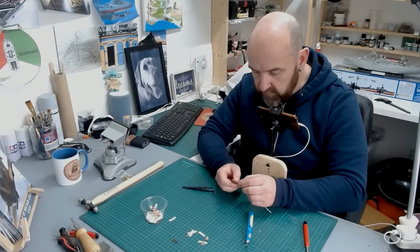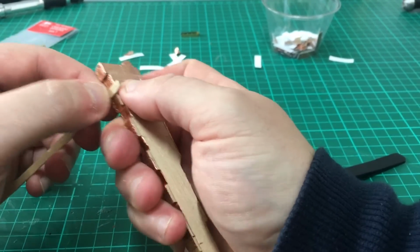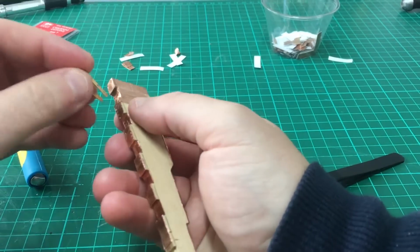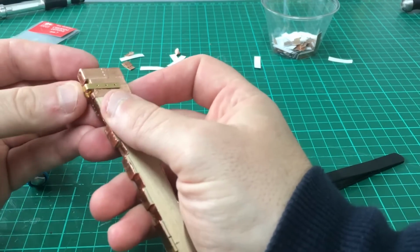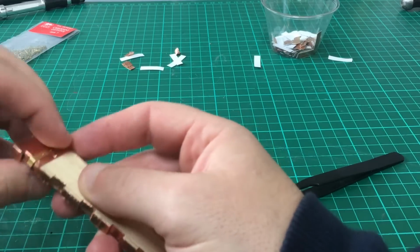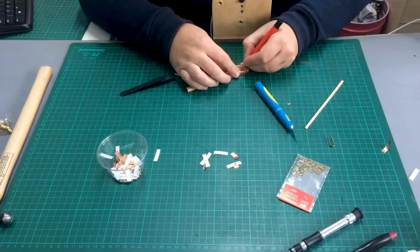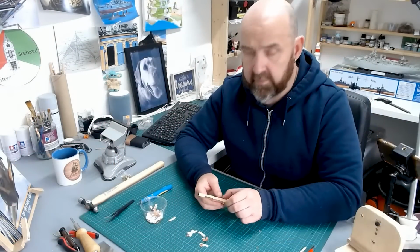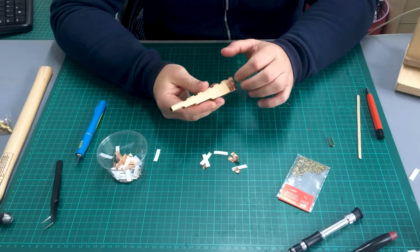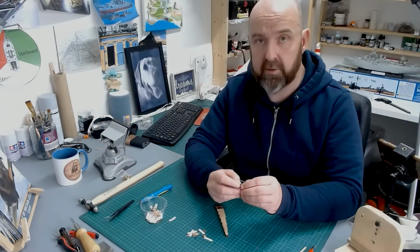When the copper sheet comes around this cut out, just using an offcut of wood, press it all nice and flat. Most of it's going to be covered by the bracket. I say when they're fitted, most of that's going to be covered. So this one, just push it in best you can, and when you're happy, just get a final press over it with a fiberglass pencil, and that's 3 rows done. Okay, so I'm going to carry on working my way up the rudder with some more of these copper tiles, and then we'll come back and start looking at the bracket arms.